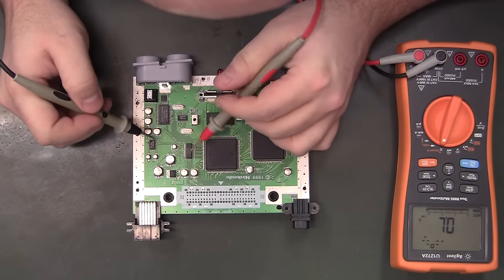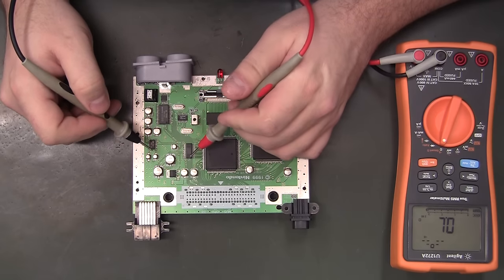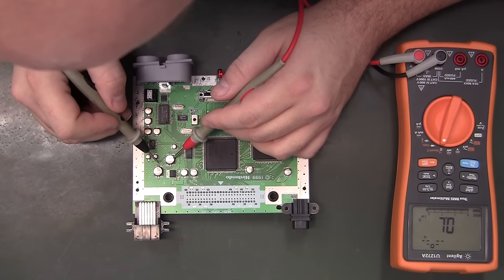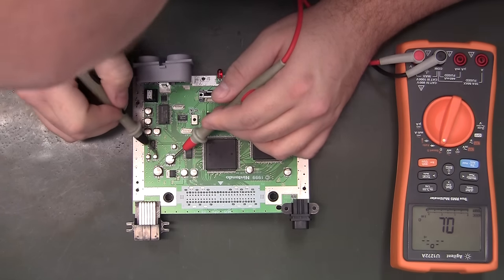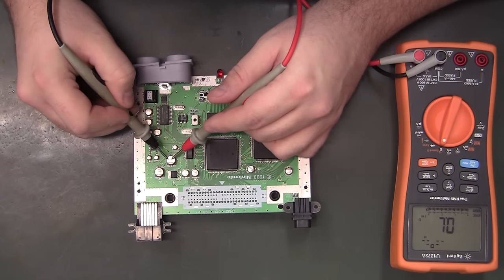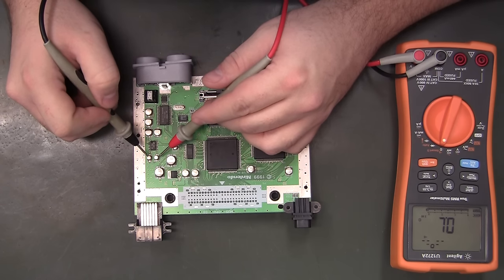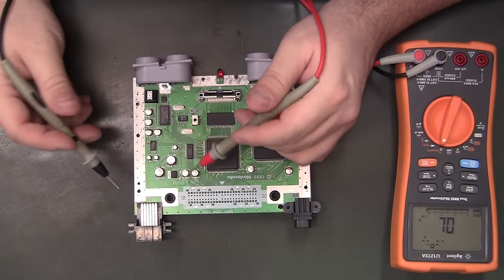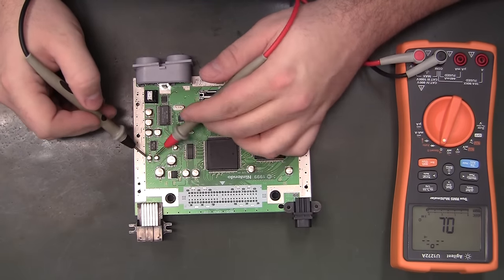So everything else except for these two are just power rails to ground. C16 and 15. Let's see, 15 is your Luma and 16 is your composite video. And then 25 and 26 are right and left audio. Since I can't do 220 ceramics anyway, might as well go ahead and do a couple of 10s that are just the regular through-hole capacitor replacement for these. If you're just doing the HDMI mod and you don't care about your analog outputs, then these four aren't going to matter to you really.